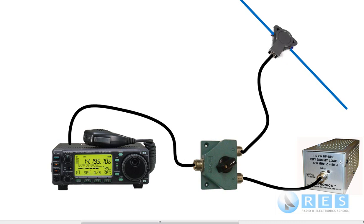The dummy load absorbs power when the transmitter is switched to it. Recall that the impedance of virtually all transmitters is 50 ohms. When a transmitter is connected to 50 ohms — as it is when switched through to the dummy load — all of the power arriving at the dummy load, which is just a large 50 ohm resistor, is dissipated as heat. There is no radiation, and this dummy load can handle up to 1.5 kilowatts.